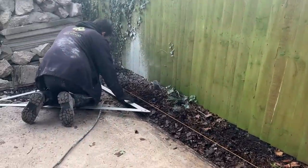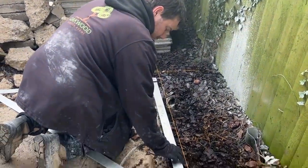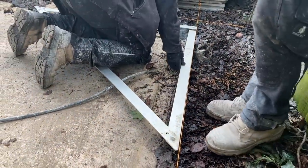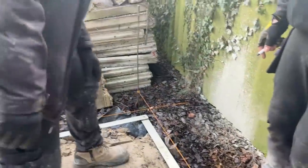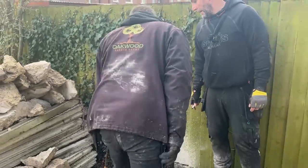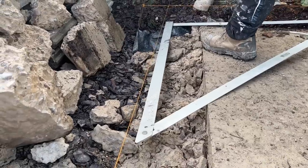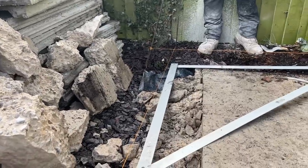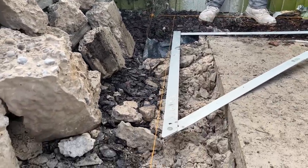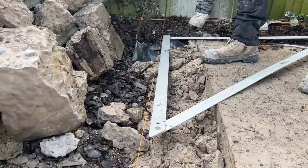You can see what he's doing now — he's putting the square down. What he's trying to do is get that line dead in line with that side, that square. He'll ask Davey to pull that line in or out. The pins actually go past the corner of the build, so Davey will drive that into the floor if there's no rock in there. You want it to go in pretty far because you don't want it to move.